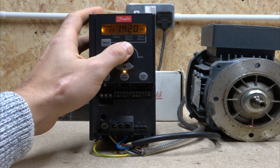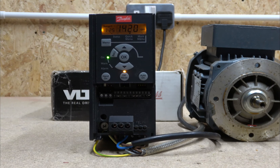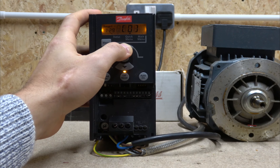The next one is RPM — don't usually touch that. It will automatically select based on the motor poles. For a four-pole motor it will straight away calculate 1420 RPM, and you don't usually need to touch that. There are two-pole, four-pole, six-pole, and eight-pole motors, but today we're using a four-pole motor running at 1420 RPM.